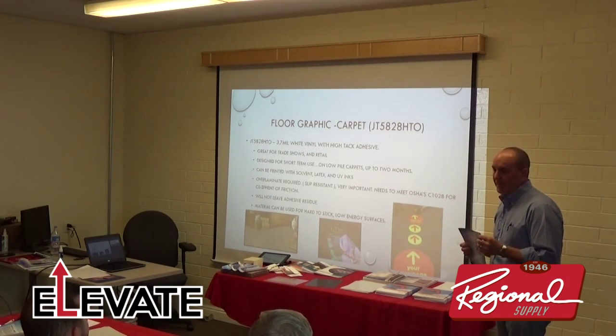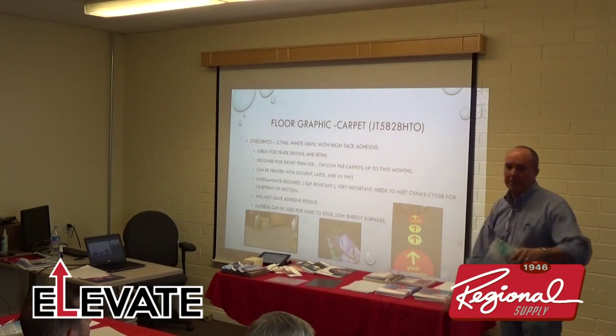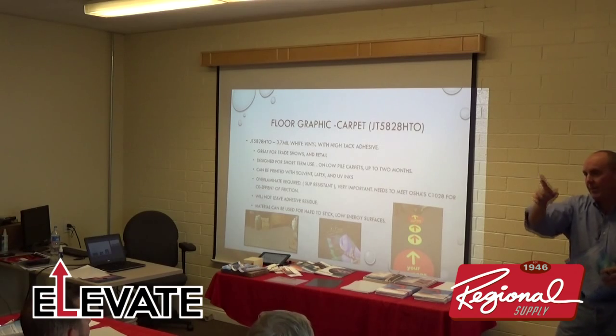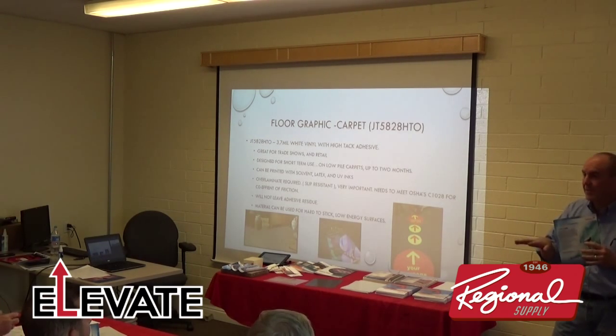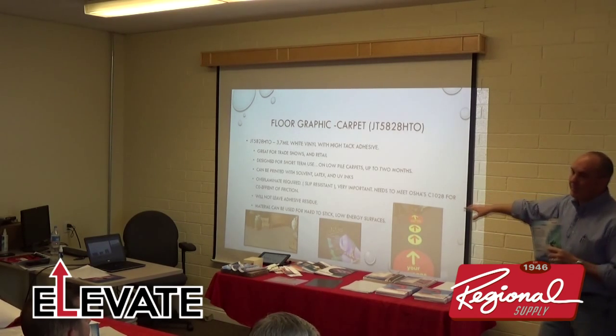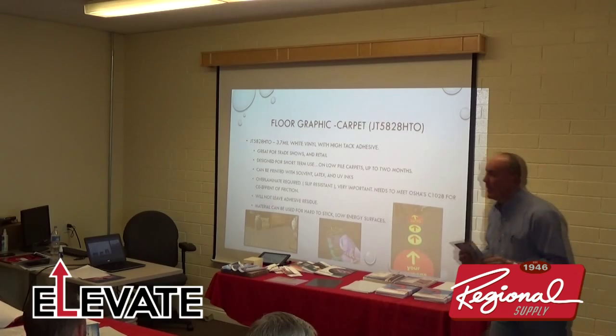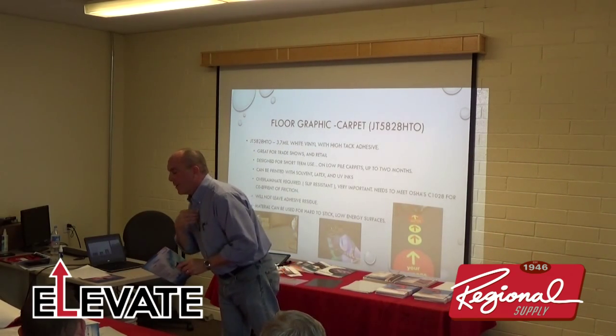What that certification means is that it's been tested by a third party for slip resistance, coefficient of friction. What's important about that is when you do a floor graphic, whether it's carpet, outside, or tile, having an overlaminate that meets that requirement protects you if somebody slips and falls, because it meets the OSHA standard. Is that on the product guide? Yes, it would be on the product guide.